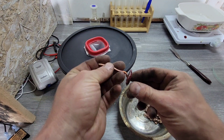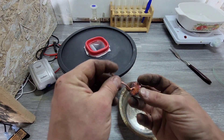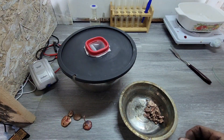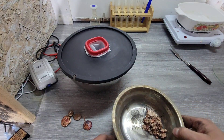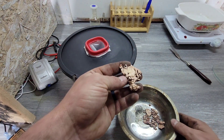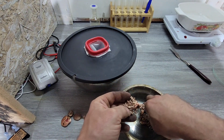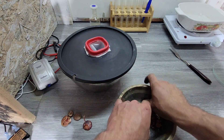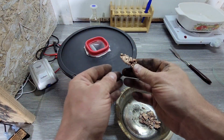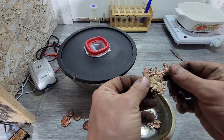Little anode — nothing crazy. I just welded a piece of wire to it so I can clip my positive side on there. And then these are the pins I melted up. Somebody had made a suggestion to melt the pins up and then just deal with the slimes, so I'm going to try that — sounds like a great idea.